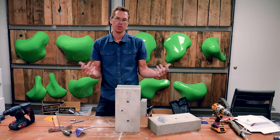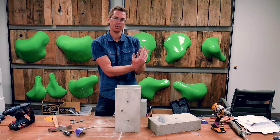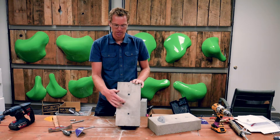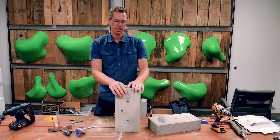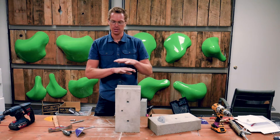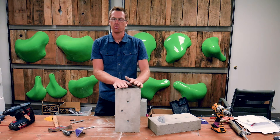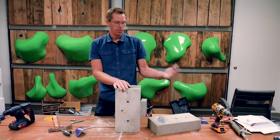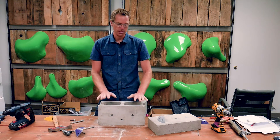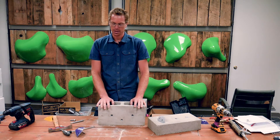That's going to act just like a T-nut in a plywood wall. With plywood walls you have a T-nut behind the panel and you can move your holds all over. By putting in either drop-in anchors or expansion anchors, you're creating that same dynamic and versatility on a masonry wall — brick or concrete — that you have with a plywood wall. Hopefully that makes installing onto concrete a little less scary, whether you're screwing it in, using a drop-in anchor, or an expansion anchor.